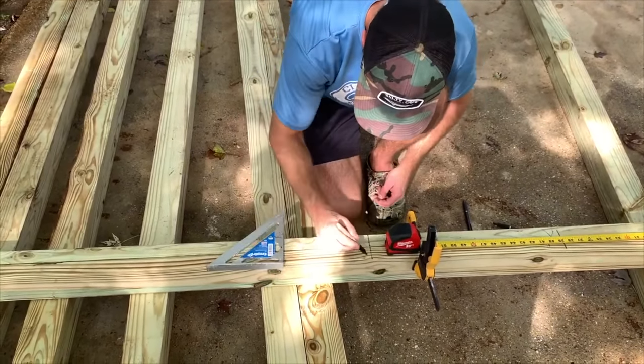Again, in theory, this should be a 6'3" long by 4' wide piece of plywood, but you know me, I always like to field measure. And there I'm using a chalk line to establish the cut line. And for this piece of plywood sheathing, we got aggressive and we simply adjusted the blade height so that it was the exact same depth as the piece of plywood, and we cut it in place on top of the shed. At this point, we preliminarily installed all of our plywood roof sheathing.